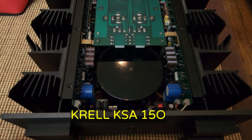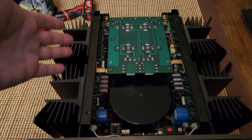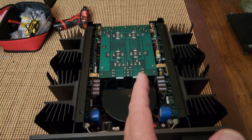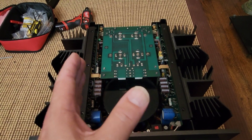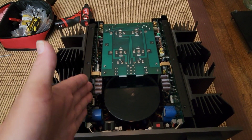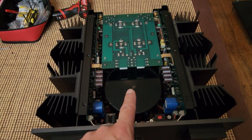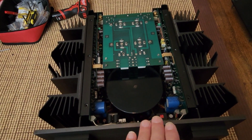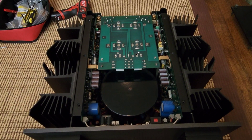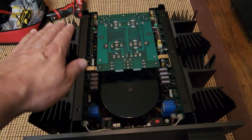Here is the inside of this amplifier. Just in case you guys don't know how circuits are laid out, amplifiers are pretty simple. There are heat sinks to take the heat away from the output devices or the transistors. This is a very typical amplifier layout — left channel, right channel, heat sinks for each channel, all the output devices, and the whole amplifier board is right here on one board. Then the amplifier board for the right side, and this is the power supply. This is the main power transformer. Filter caps are underneath there. Every basic amplifier since 40 years ago is going to be this same exact design — one amp board here, the other channel there, a power supply in the middle, and heat sinks to take the heat away.